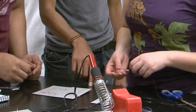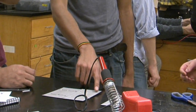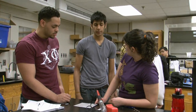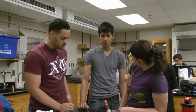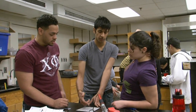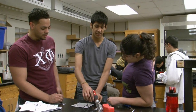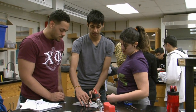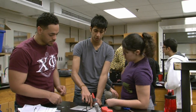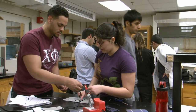You should also probably cut this shorter, because this is electrically conductive even though it's not tabbed — the entire surface is electrically conductive, so if it's touching something it's going to short. All of these form one surface that's electrically conductive. The tabs are just there to make it easier to solder onto. If you have two of these right next to each other and a wire is touching the back of one, you're going to short it. All you need is from here, just this much wire.